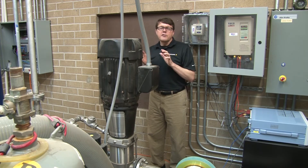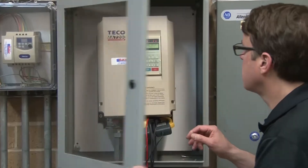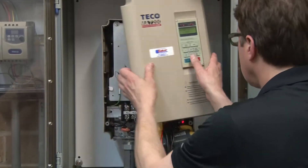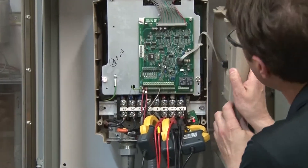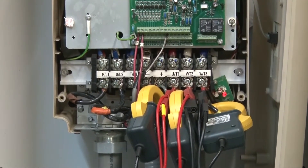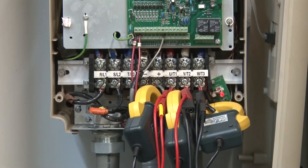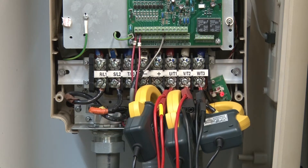Because the motor requires a three-phase supply, I'm driving it with a three-phase motor drive. I have connected to the motor drive output using spade connectors and safety leads for my line-to-line voltage measurements. For convenience, I am using three low-cost current clamps for my current measurements, one on each phase. The motor drive output is a three-phase delta source — I do not have a neutral here, simply three wires and a safety ground. The power meter voltage leads are connected line-to-line, not line-to-neutral.